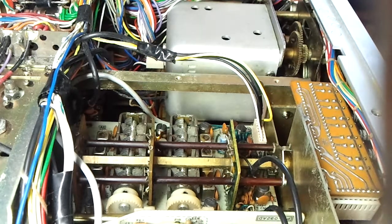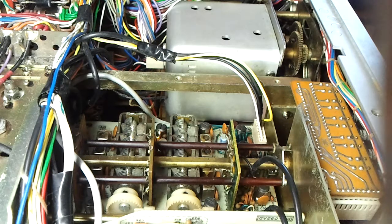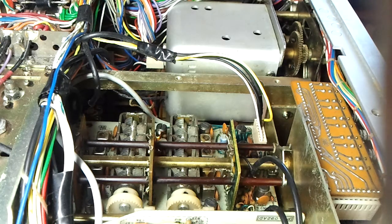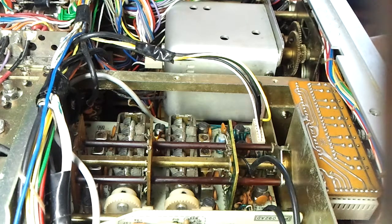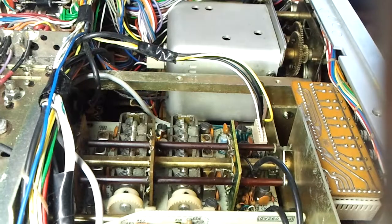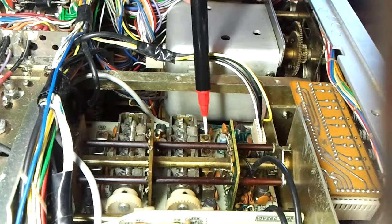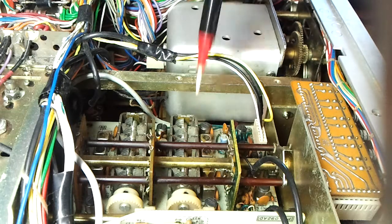Put the output up a little bit. This signal generator of mine, whilst it's okay for a lot of broadcast band radios and the lower short waves, it gets very difficult to tune with any degree of precision as you get higher up in short wave. Anyway, we're on 15 MHz now and I've tuned in. I can't peak that one with the right alignment tool, so I'll peak the secondary. It's quite a sharp peak.